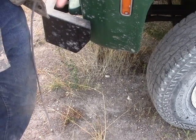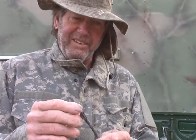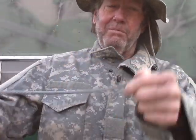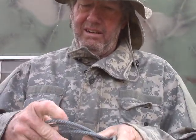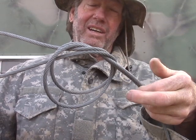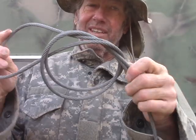Now that you've cut the cable to the length you need, how do you make a choker out of it if you don't have any cable ties or anything like that? With something this small you can actually tie a knot in it — take a big loop and make an overhand knot and just pull it. It's going to kind of screw up your cable and look ugly, but it would work if you've got plenty of cable and it's light enough. With half-inch or three-quarter-inch cable, you're going to be in trouble.